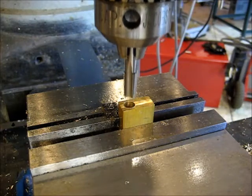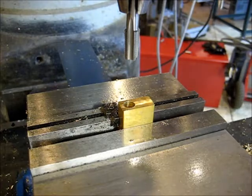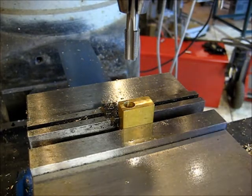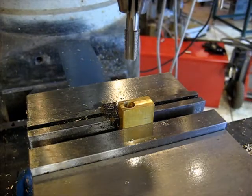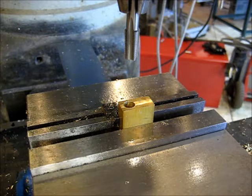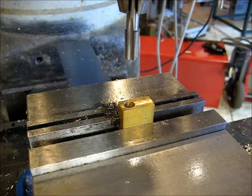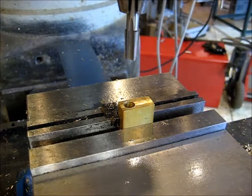And I've got the eighth inch pipe tap in a drill chuck here, but I'm not gonna power tap this completely. I've got it in back gear, about 90 RPM. So what I'm gonna do is I'm gonna fire it up. I'm gonna feed the tap down right as it engages. I'm gonna kill the power. It's gonna give me a good start. Then I'm gonna take the chuck off. I'm gonna put the handle on, and I'm gonna finish it up.